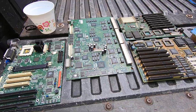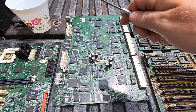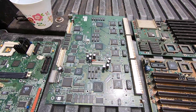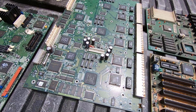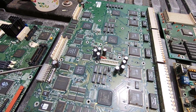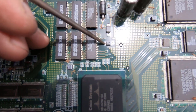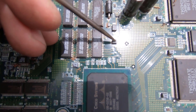Now this board here is a pretty classic telecom grade board. It came out of probably a Cisco — yes, it was a Cisco because I can see Cisco on the board. So what you can see on this board right here is a black tantalum. However, notice that there's no plus sign on the capacitor itself. It's just a gray bar.